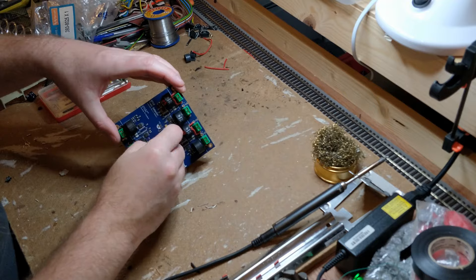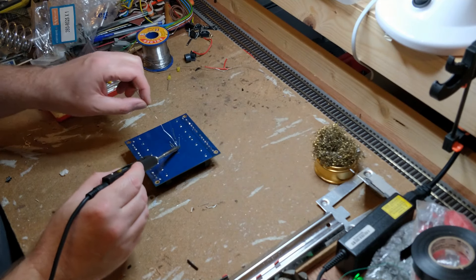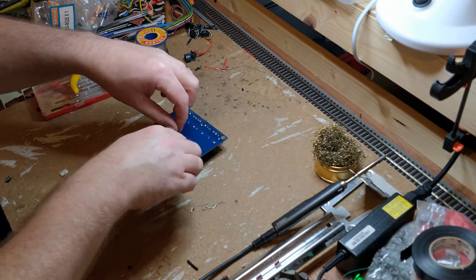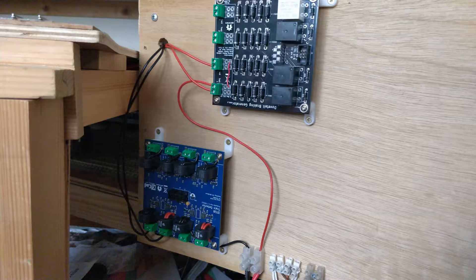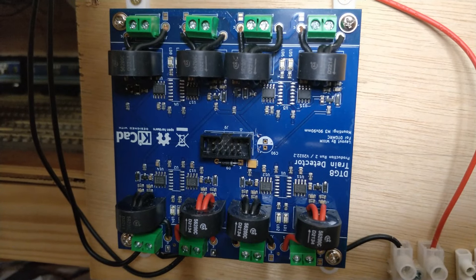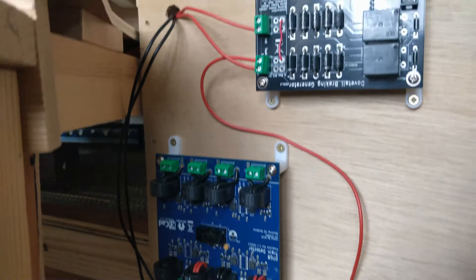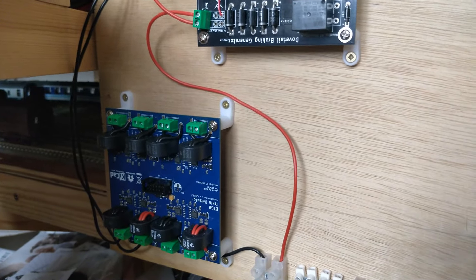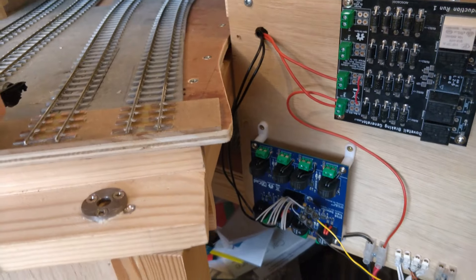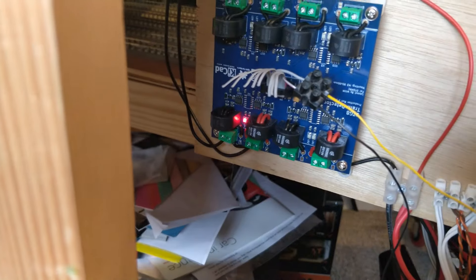And we're back. Lighting has changed because it turned out that in my stock of diodes I had precisely zero 1N5819s. Remind me next time to just make this a surface mount one rather than trying to get clever and making it optional. With that fitted, let's test this out and prove that it works before assembling the rest. To test it, I need a DCC signal with the ability to add or remove a load, and a 5V power supply. I've wired it into the layout here, these two black wires going to the southbound track of each pair leading away from the bridge. The 5V power is coming temporarily from another board in a different location. The test load is a 10K resistor across the pickups of a Bachmann bogie.